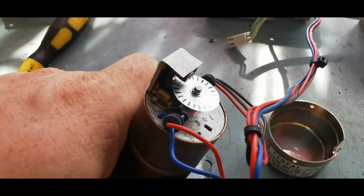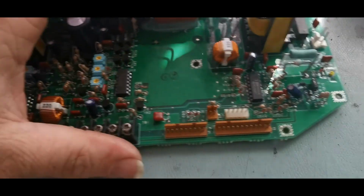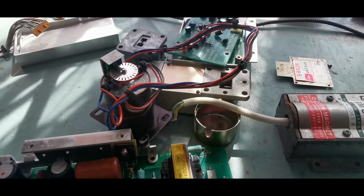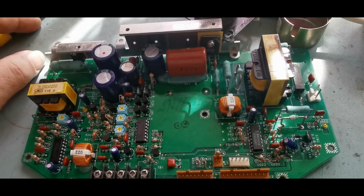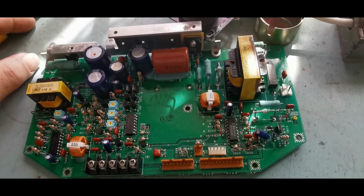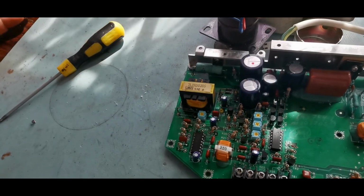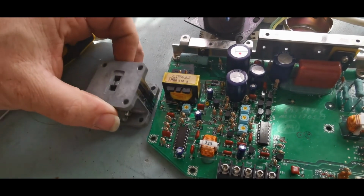And again, a lot of this will be passed without any encoding, straight down through this connector here, straight back to the receiver. So there you go. There's not a lot in there, and given what's going on and how complicated the whole field radar is, it's really not that complicated electronics-wise. It looks it, but a lot of that is down to the fact this is quite old technology. There's not really any surface mount in here anywhere. There's a fair amount of mechanics, and a fair amount of black art witchery type RF stuff going on here,